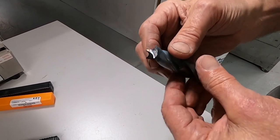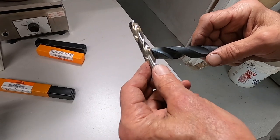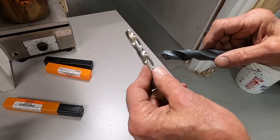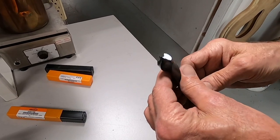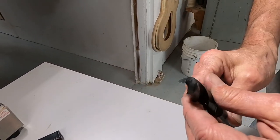Additionally, we have to make sure that there's enough clearance. So in other words, when the drill rotates through the wood, there has to be a clearance angle. In other words, that would be no clearance. This would be clearance so that the drill can screw into the wood. And to some extent, the amount of clearance that you give the drill governs how quickly it can penetrate the